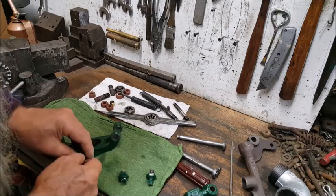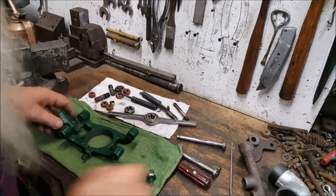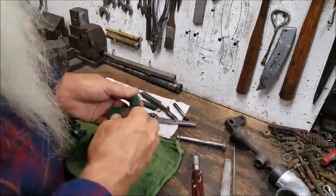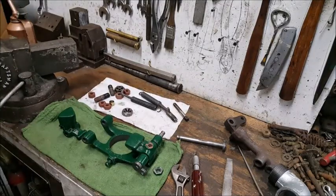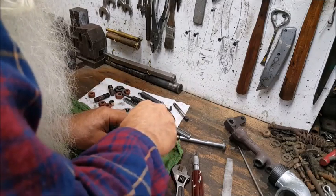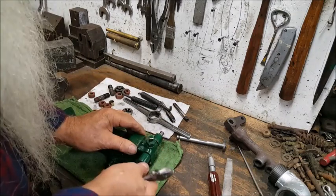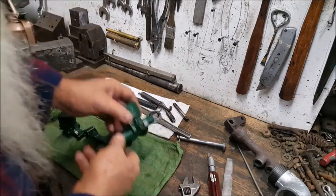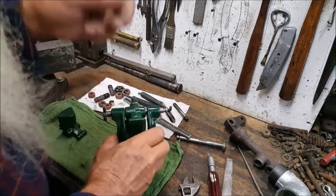You preset that in there to a little less than what's necessary right there. But to put this thing together — right in there, I can look down in there and see that. That should be back exactly to factory setting, and when you come around like that, that's your lock nut right there. I'm going to take it back apart and put shims in it to take up for this side play in this area, whatever that amount is, to match up to the flywheel casting.